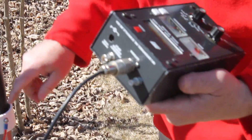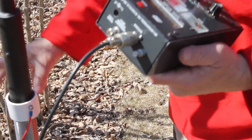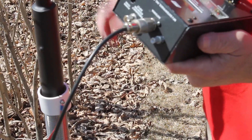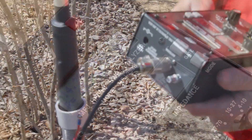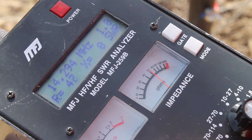With the coax connected I hooked up an MFJ antenna analyzer. Now this, in my application, is two clicks down from the top. Every time you move this collar it'll actually click, and you can hear that. So this is just two clicks from the top, and with these two pieces up here, this is just one click down from the top, and you can see there's 20 meters.